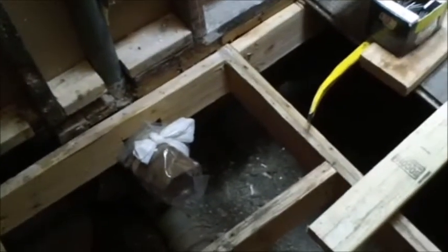Now the next big issue — it's time to decide how wide our shower is going to be. It was originally going to be a bath on this plane right here, but we now have the ability to shift the soil stack for the toilet over. So we want to make some measurements. If we move the toilet so the stack is over there, we need to have 15 inches clear on both sides of that toilet measured out to the finished walls. We need to figure out exactly how wide we want the shower stall.